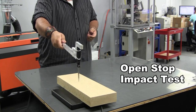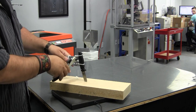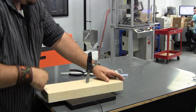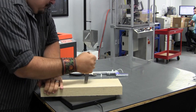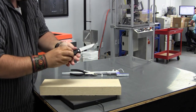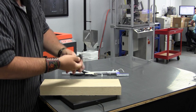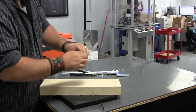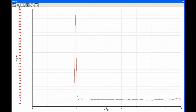Here's something we haven't included in a video yet. As you can see, we set a thick piece of oak on a force plate and then drive the knife into the material in a stabbing motion. This allows us to check for deformations or failure while recording the amount of impact generated from the test. Now once I get this knife removed from the block, we'll check the action. It seems to be functioning great — can't find any up and down, can't find any side to side. I call that a pretty successful test. We'll go ahead and check the data from the sensor. Looks like that impact was about 305 Newtons, or about 68.5 pounds of force.